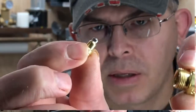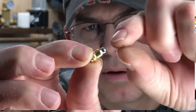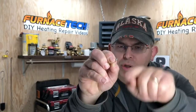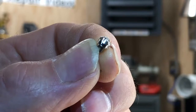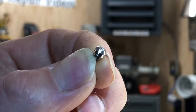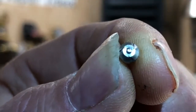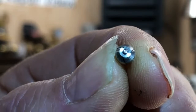This is the piece that came out from inside of the nozzle tip. You'll notice this piece is in two pieces. See how the fuel actually sprays at an angle — kind of a twisting motion — there's a little groove right there. The fuel actually follows that path that's cut inside the metal there, and gives it a kind of spiral swirling effect. It's a really good view.